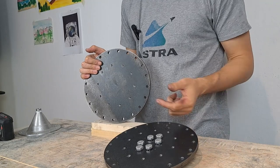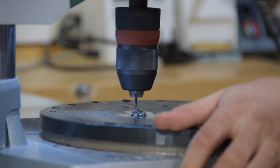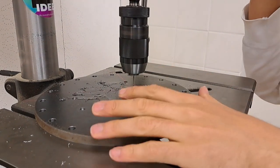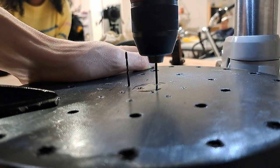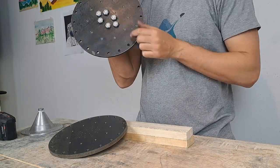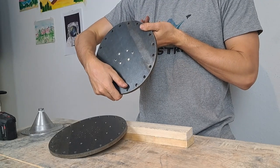The final aspect of the injector plate are just these little tiny holes that we had to drill. These can be a little bit of a challenge depending on what kind of drill you're working with. Because we're drilling through steel, which is a pretty hard material, there is a chance that you could get a drill bit stuck as you drill it. So you have to move slowly and use lots of drilling oil — without it, you're definitely running a high risk of either getting the drill bit stuck or potentially breaking it. For the impinging injector, we had to get a little more creative to figure out how to drill holes that converge on each other, considering we only had a drill press that could drill straight downwards. Our solution was to drill holes into a bolt at an angle, and essentially screw that bolt into the injector plate itself. We have six bolts which have been screwed into our injector plate — just M10 bolts — and we made M10 holes and threaded them to allow this to happen.